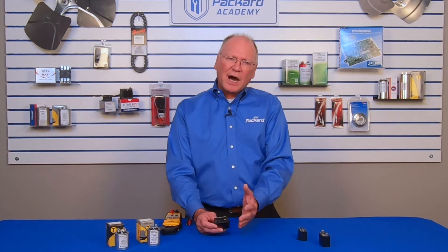On these dry run capacitors, I'm limited in terms of how much microfarad rating I can get out of it because of the small size. Not only am I limited in microfarad rating, but I also can't go very high in voltage. We'll typically see 440 volts as the maximum voltage on most of these, and a lot of times the voltage will be less than that.